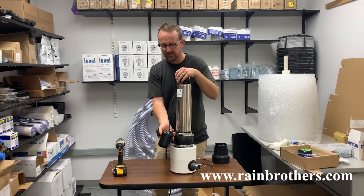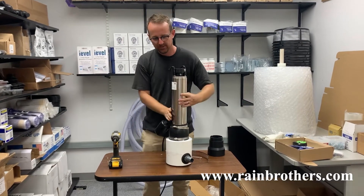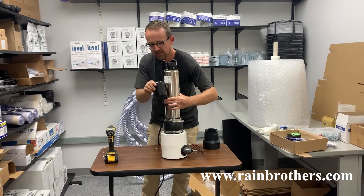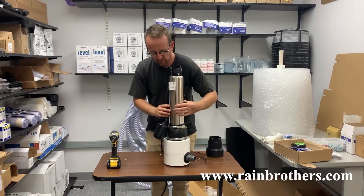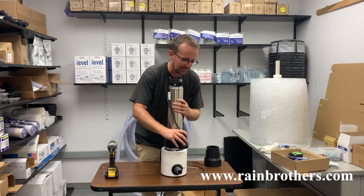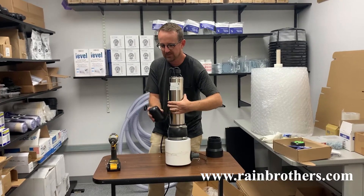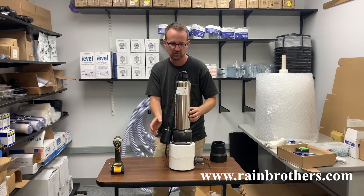The reason we want to tether it is that if we just leave it, it has a very wide swing in operation. You want to either tape it or zip tie it with about four inches of cord exposed, securing it to the body of the pump. That way the swing is much tighter to the pump body, which allows for a better installation. You also want to make sure you secure it on the opposite side of the floating intake tube so it doesn't get tangled up or interfere with the Tiger Flex piping. With this secured, in the upward position the pump will be operational. When the water level starts to dip, your pump will shut down as it should, so there's no risk of running dry.